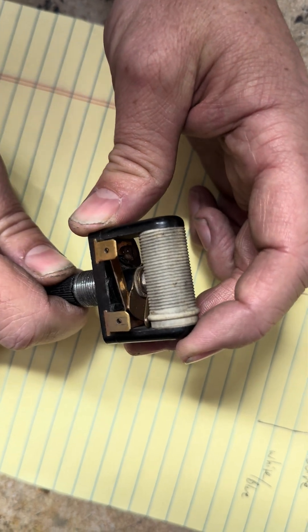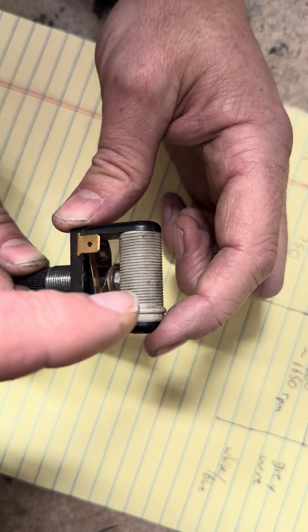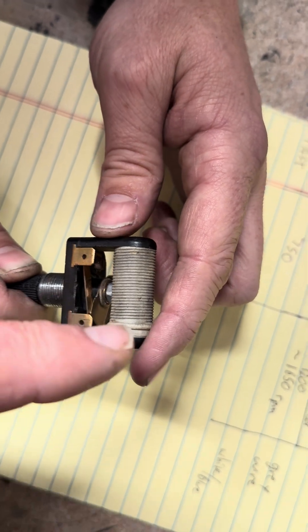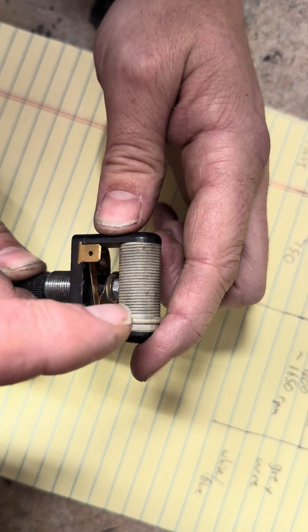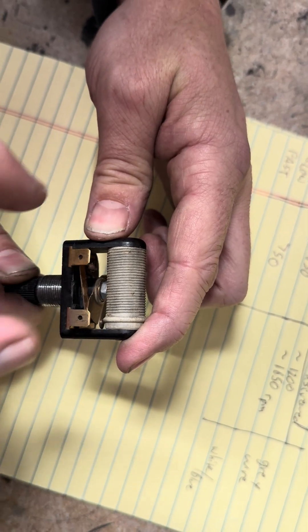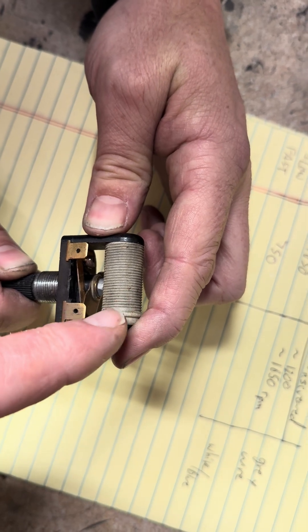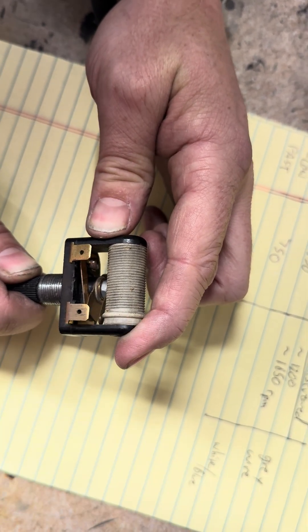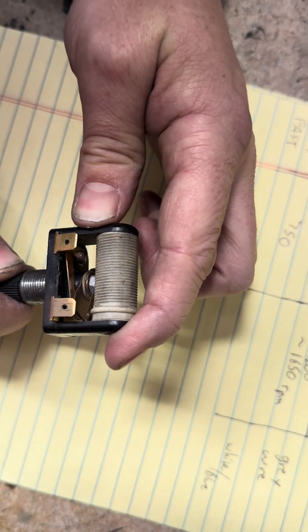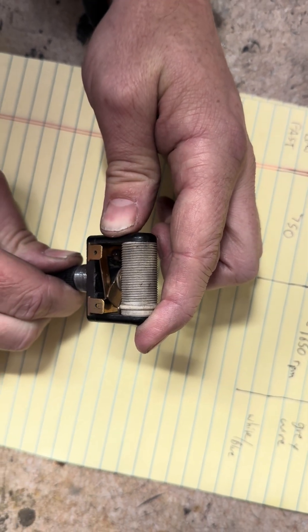When you get down to selecting only a few coils, that's a lot of amperage going through just a few windings. So this is a safety device that immediately causes no resistance to occur so that the small number of wraps at the very end are not overheated. That should give you a better idea of how this thing functions.